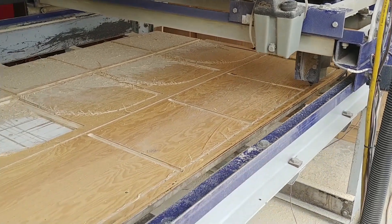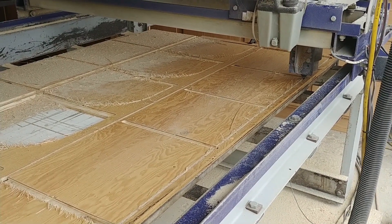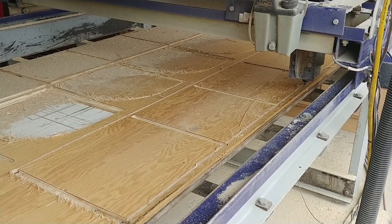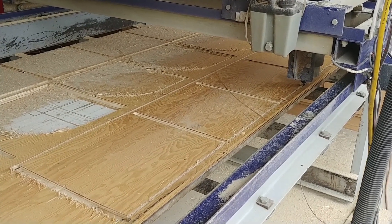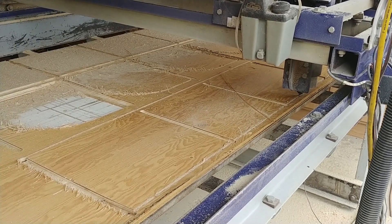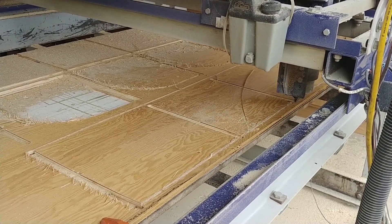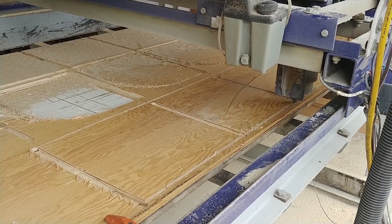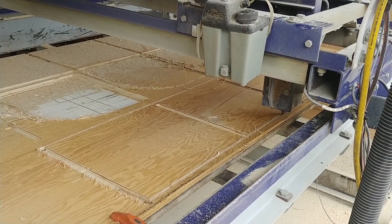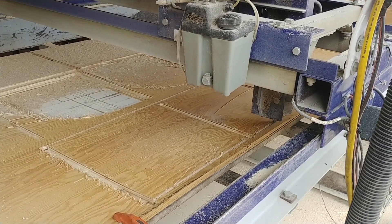At this point I've reached the end of the project. This is the last cut file I put together, the last toolpath, and I've got a quarter-inch bit in there. It is half an inch deep and I have three-quarter-inch plywood, so my tooling is just horribly ineffective. It didn't actually cause any problems other than it just cut very, very poorly — it's really not designed for plywood. The other issue is that it didn't cut deep enough. I did get one side out, but not the other one.